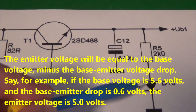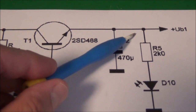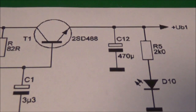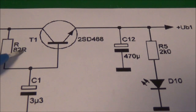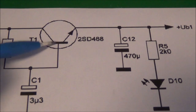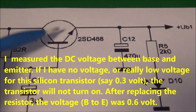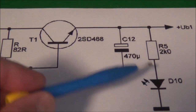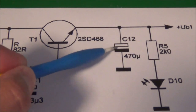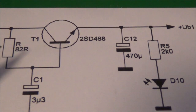And this LED here, this control lamp, wasn't coming on at all, so that told me right there nothing's getting through to here. So at any rate, sorry I wasn't able to show the complete troubleshooting, but that's how you would have to go about it. And of course, between base and emitter, we should have some kind of bias voltage, maybe about 0.6 volts or so. After I put everything back together, that's exactly what I had. And this resistor here is just a dropping resistor, and this is just another little smoothing capacitor. So that was it, and thanks for watching.